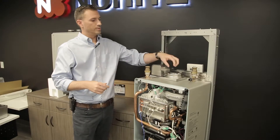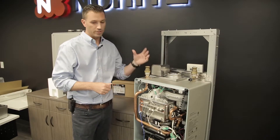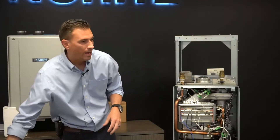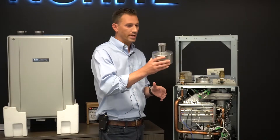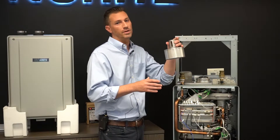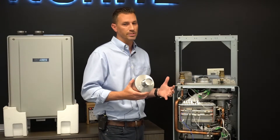This is going to allow you to have your intake air coming through here with a protected screen, as well as being able to attach your two inch flexible venting from the top portion of the heater. You can run that all the way up to the top of the house through the existing B vent and terminate with just a universal rain cap that pops right on top — making the venting through the existing B vent extremely easy.